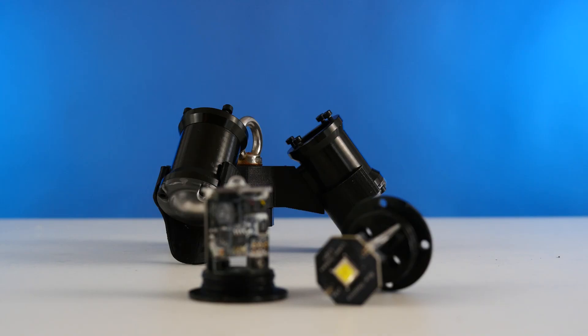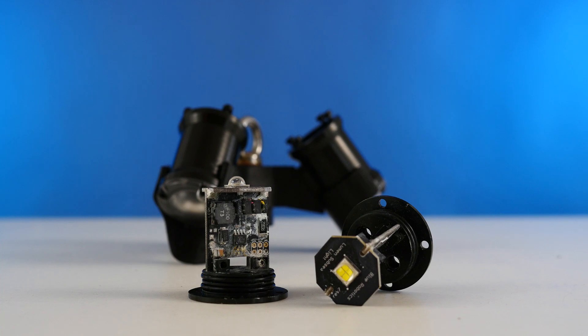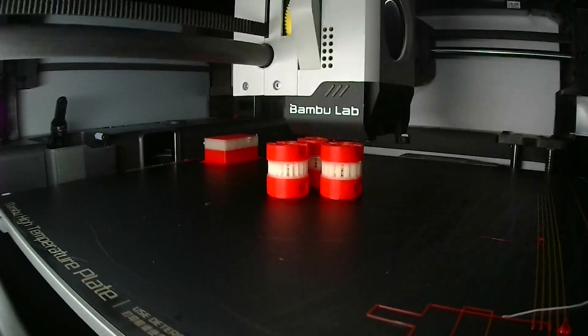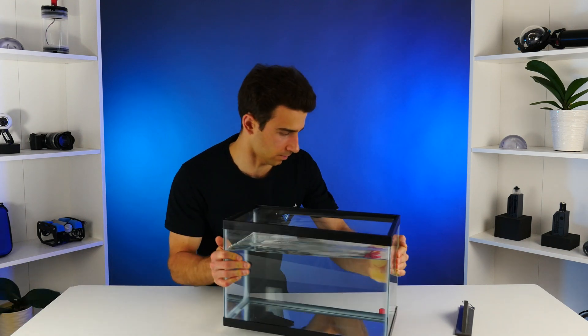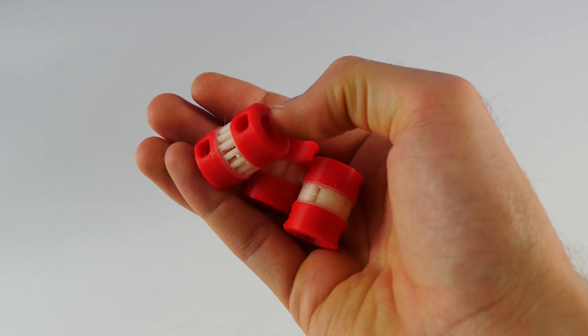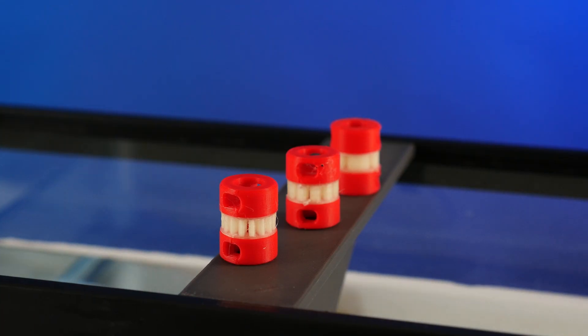While those releases are getting printed, I wanted to take a closer look at the lights and figure out what went wrong. After a closer inspection I noticed that one of the O-rings was a little bit damaged, and that most likely caused the leak. Although we're not going to be using this type of lights on our main drop cam, it's still important to understand why things fail. These turned out pretty nicely — now I just need to set up the aquarium with the weight release mechanism, and I'll also be putting a water pump in there to make sure the water is circulating, to get a more realistic release time. I made a few different versions with a different number of cutouts, since a greater number of cutouts means more surface area and faster dissolving.